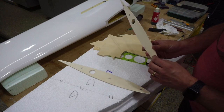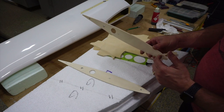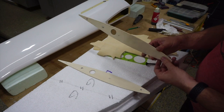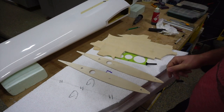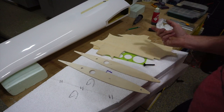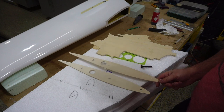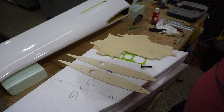The backing circles give extra surface area when I glue the root ribs into the foam. I'll recess the foam a bit so the blocks stick into it and also glue into it, giving extra surface area for the glue on the root rib. This really supports the bolt so nothing can come apart — if that root rib breaks off the root of the wing, your wing is going to go bye-bye. I'll cut those out of the quarter-inch light ply on the scroll saw.